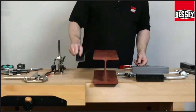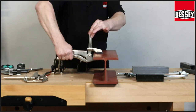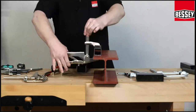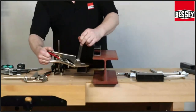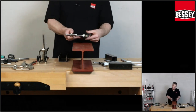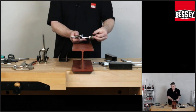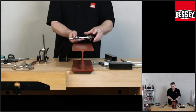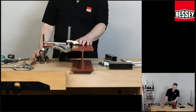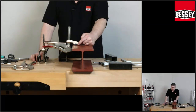The next one is the normal clamp — it's self-adjusting too. It's closed. Now you can fix it like this. It's closed. On the blade it's plastic — it protects the surface. It protects for stainless steel. When you need to weld stainless steel, you need this plastic protector. You can weld complete inox and stainless steel with this. But don't weld directly next to the plastic pads — they can handle a little bit of temperature but not direct welding next to them.